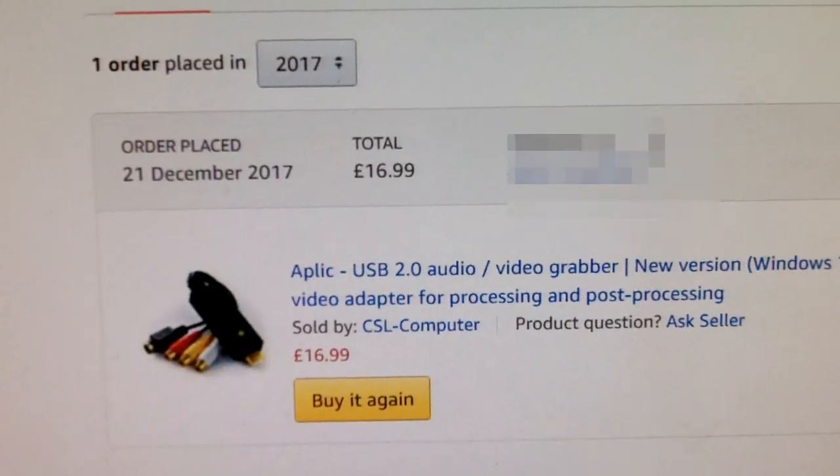This is not a permanent solution. If your tapes are going mouldy you might want to look at why. I would only recommend this if you're going to be digitising them — if it's a tape worth something, maybe get it done professionally. Just to recap: put it in the machine, fast forward all the way to the end, clean the inside, then rewind and repeat until both sides are clear, and then you should be good to go. Also use silica gel packets — those little packs you get with electronic equipment — chuck a load in with your cassettes to prevent future mold.